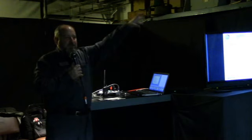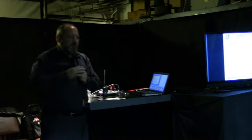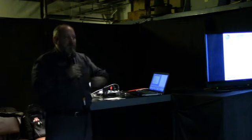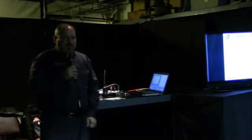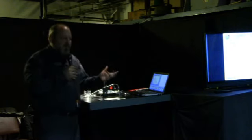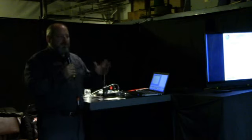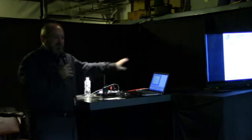I can have those guys connected on one side, and I can have our local DSTAR users connected on another side. They're all running the same software and have all the same functionality. They don't really know the difference, other than it's a lot easier for me to hook up a DSTAR radio because I just plug in the cable, whereas they have to go through the packet setup and get all the TX delay and all that other stuff set up, which you don't have to do with DSTAR.